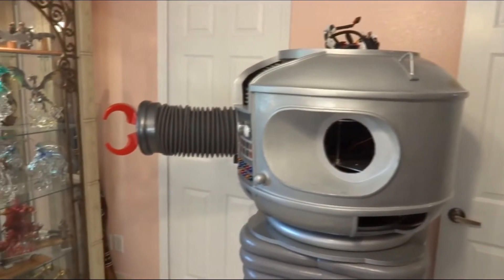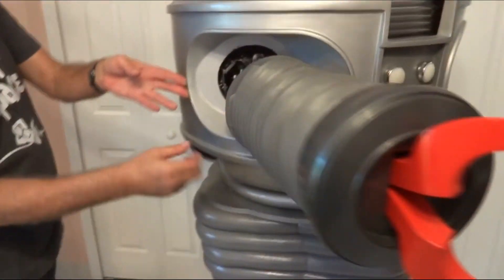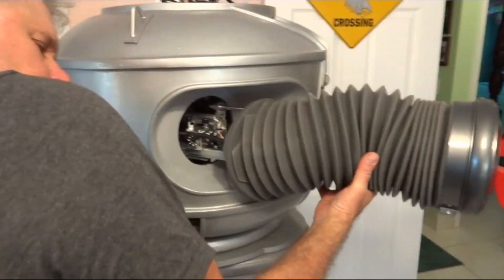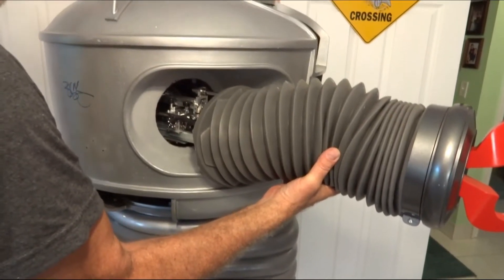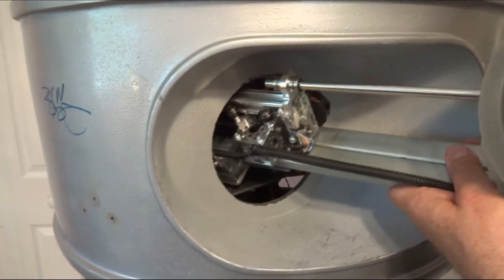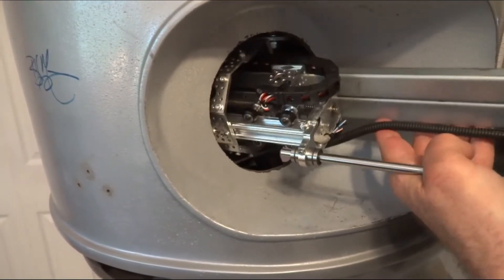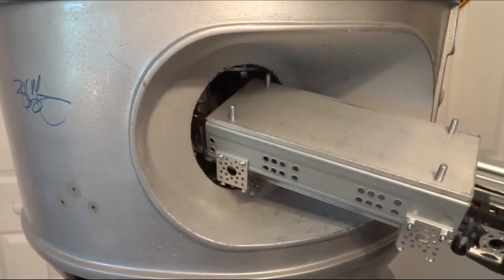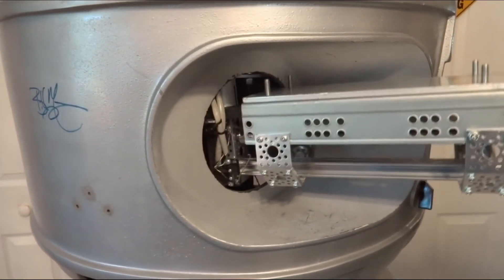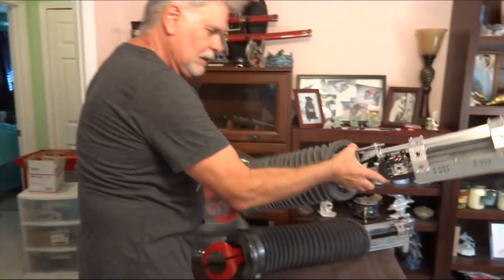Okay, you want to do it to the other side? Sure. I've got the screws off already except for one aft screw — a wing nut. When you put them on, they should be finger tight by the way. Now again, this side is counterclockwise — left side is counterclockwise, right side is clockwise. Half turn. Gently work it out. Get those nuts past there. Bring it so all the nuts are out and again you see the motor there. Tip it up and it comes right out. That's it for the arms.